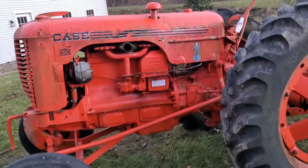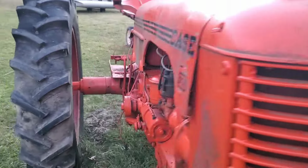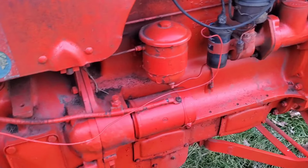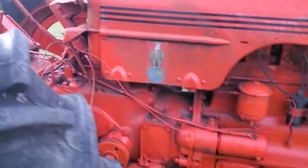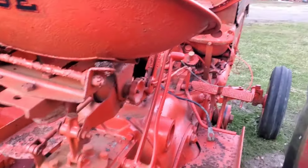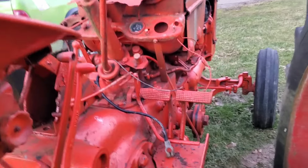So tonight, we got it to crank over. We got it to blow smoke rings. It shot a bunch of fire out. But we're fighting with wiring that's bad and bad battery cables that aren't quite big enough and a starter that is probably in need of some help and cleaning. So we have proved that the engine can sort of run and doesn't have any clanks or rod knocks like the other one did, unfortunately, for it.